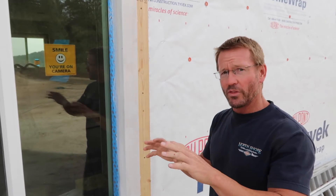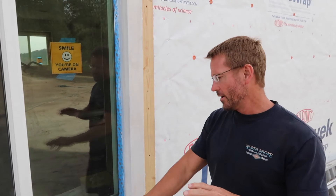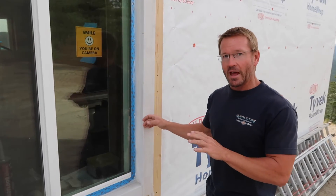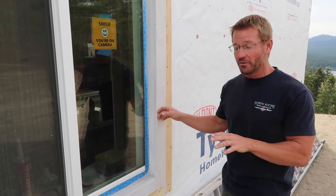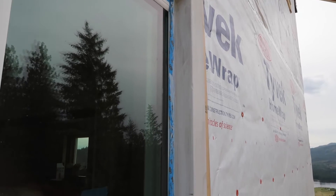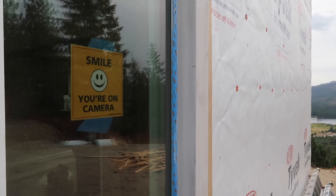What I did is I sealed it again — I sealed the inside that was recessed, sealed the subframe with caulking, then hit it with RedGuard, the same stuff you've seen me use in the crawl space video. Outside, he screwed up as well. I want to show you the solution that would actually work. It was expensive — four-foot 4x4 cedar finished is not cheap — and then all the labor we had to put into it.